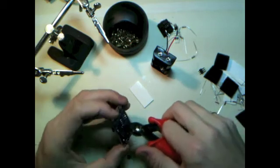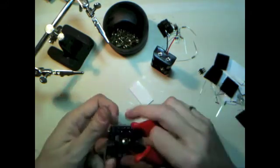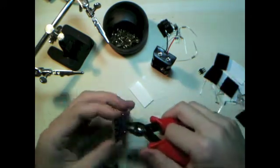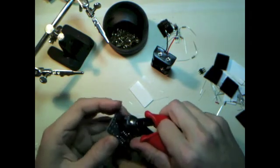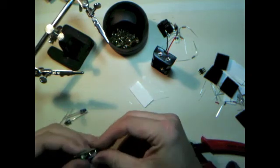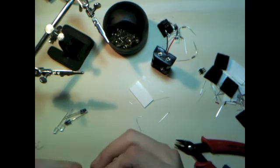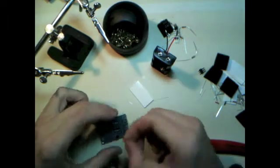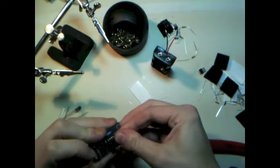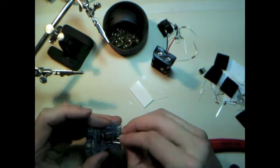I'm a little disappointed in these cutters — I've worn out the tip a little bit, I probably need to get them resharpened. But perfect for cutting these leads off really close to the board. And as always, after every bit, I give a little visual inspection on both sides to make sure I haven't forgotten to solder something. Gotta watch with this little button here — I used to always put my thumb on the far side of the board and just pinch together, and then I'd end up stabbing myself with the legs, which is like a vicious little spider bite. I suggest just keep your thumb out of the way.